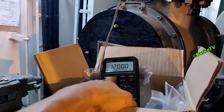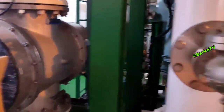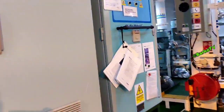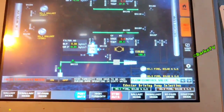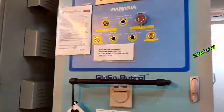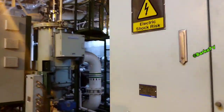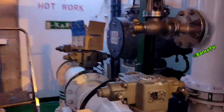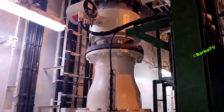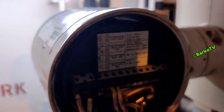We also check 8 milliamps — the output reading is 188, which is correct. The important thing is that 0 to 750 is the range, equivalent to 4 to 20 milliamps: 4 milliamps equals 0, and 20 milliamps equals 750. The signal is good, but the problem is the cartridge — the cartridge for this flow meter.